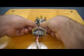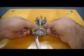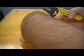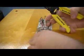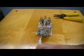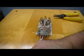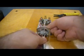My hot connections are further back than the ground and neutral, so I'm going to need to trim these down. For the sake of time I'm going to cheat a little bit — I'm actually going to pull these wires back through the Romex. Normally you wouldn't be able to do that, but I'm cheating just for the sake of time. You would need to adjust the wires so that everything fits where it should.